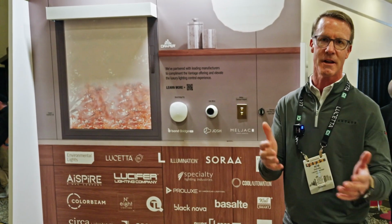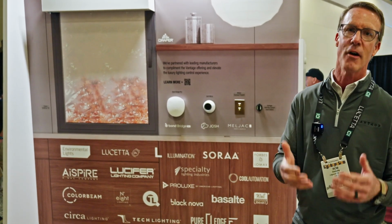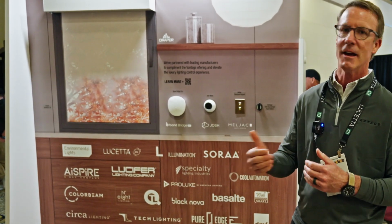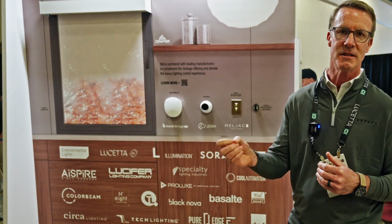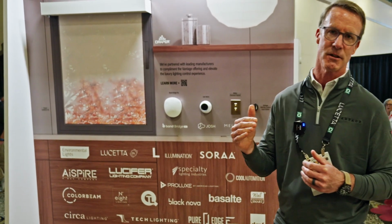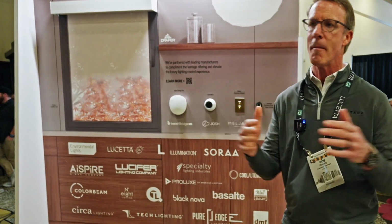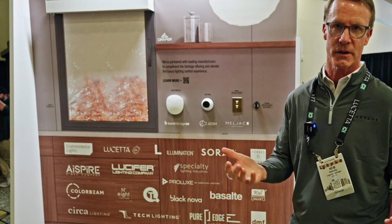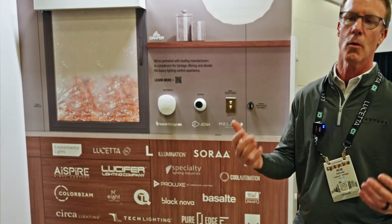But ultimately what it does is it makes it easier on you, our dealers, to commission a tunable lighting fixture application, calibrate the CCT, and set the dimming intensities properly for your clients. So you've got a consistent aesthetic, no matter what type of fixtures or number of fixtures you may have specified in that room that could be tunable, warm, dim, what have you.